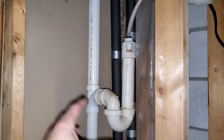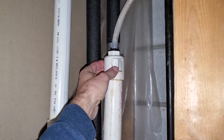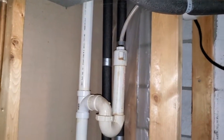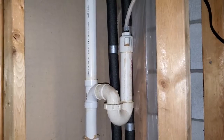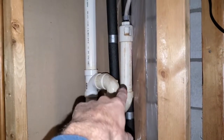So that way, if anything were ever to happen — sewage backing up into the line — it's not going to get into the drinking water, because we have an air gap. It would just spill out. The potential for siphoning of wastewater into the drinking water system can't happen because of that air gap, and that's why they require those.